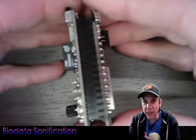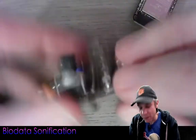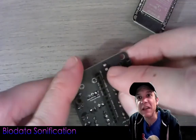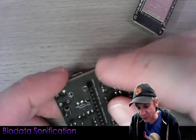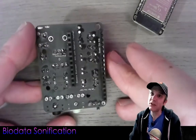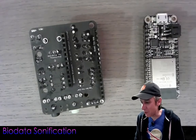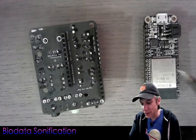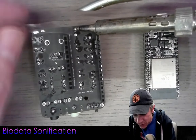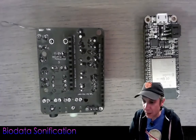During the light show at boot, I notice the top LED is not illuminating — something's wrong. I'll unplug the system, turn it over, and look at the top LED. The top pin does not look very well soldered. Even I can make a very easy soldering mistake. You have to be very careful, very patient, and always test. The code is now uploaded, so I'll turn the soldering iron back on and re-solder that top pin one more time.